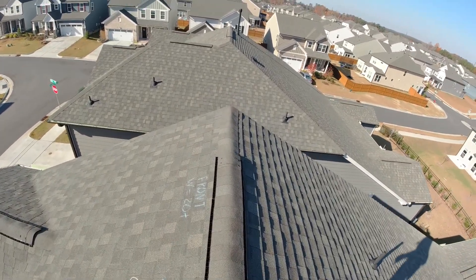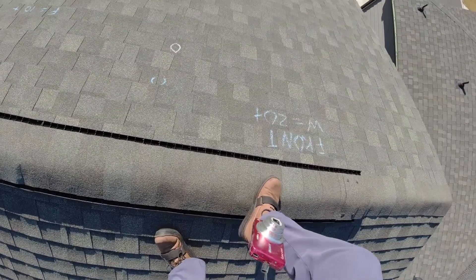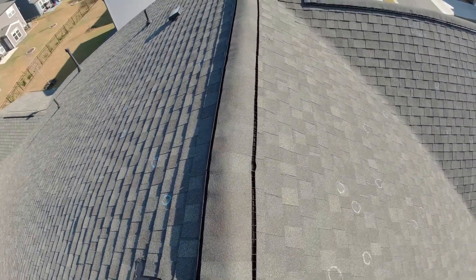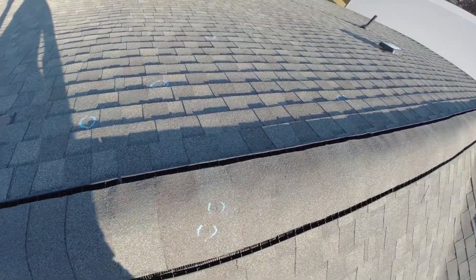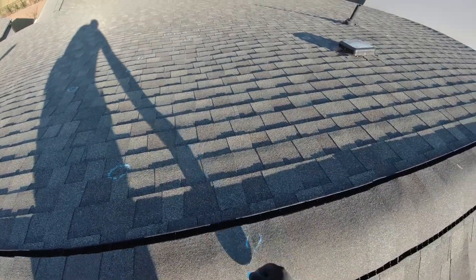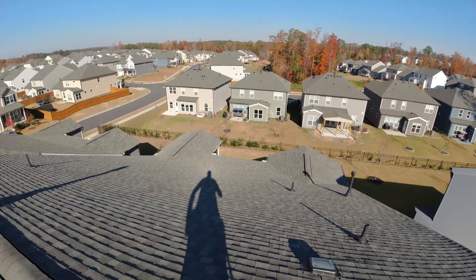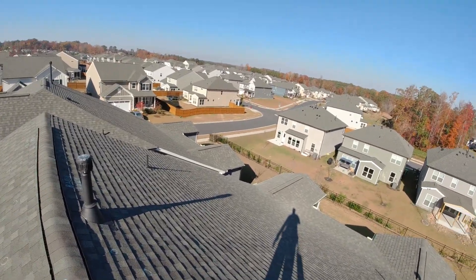Look up on the ridge. See how my foot kind of caves in on the ridge? It's nice and soft. This actually protects quite a bit from hail damage because it gives a little bit — it doesn't have as much resistance to cause damage. The damage is not going to be as significant on the ridge mainly because there is a little flexibility. Think of the solid wood that the shingle is mounted to — when damage occurs, it's hitting something really hard with no flex.